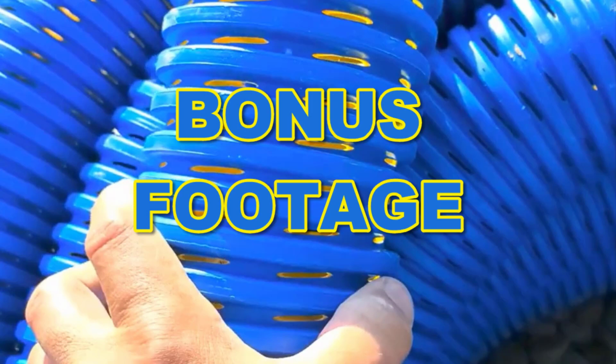No, this is different. Your yard drain pipe in a French drain is surrounded by stone. So the pipe itself is the greatest void in the French drain system. So you want a pipe that's going to take in water from 360 degrees, all around, sides, top, bottom. You want it to take in water from everywhere, and that is the giant void. Now, we like to put 2, 3, 4 pipes in a trench because we're creating more void. We're going to move more water. I gave a brief explanation on how this works in a video, and I'm going to put it on the end for bonus footage.